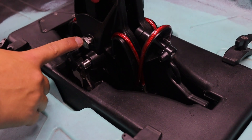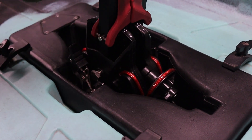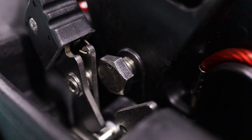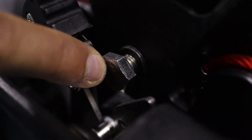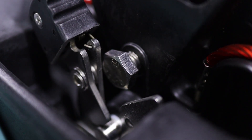If this bolt is not correctly fastened to the kayak, you will see that if you try to remove it, it will first catch on this hook. And if you're trying to use the fin drive, it will eventually hit on this clip because it'll start loosening itself slowly, and when hitting here it will catch on this lip and you will not be able to use the fin drive.